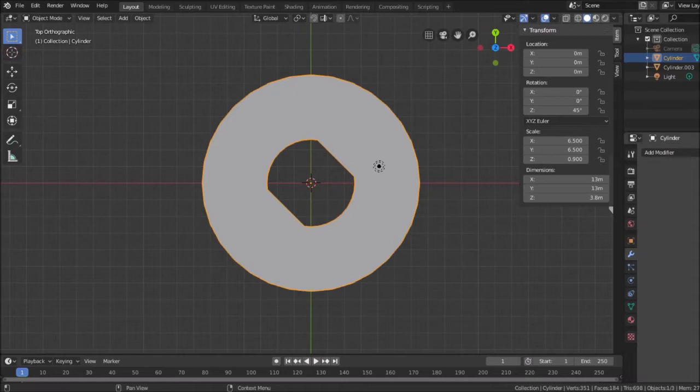My numbers for that were, again, how did I do that? I did not measure a virtual outer circumference because that tab, when you visualize it, is actually a bigger circumference with a lot of it cut away. So the tab width, or the sweep pad, what did I call it? I called it the sweep pad. The sweep pad was 7.6 millimeters in length, and did I measure that from the inside edge or out?